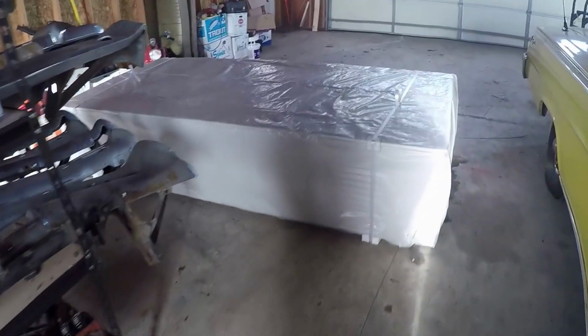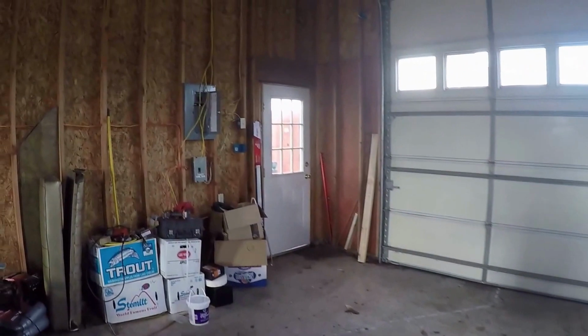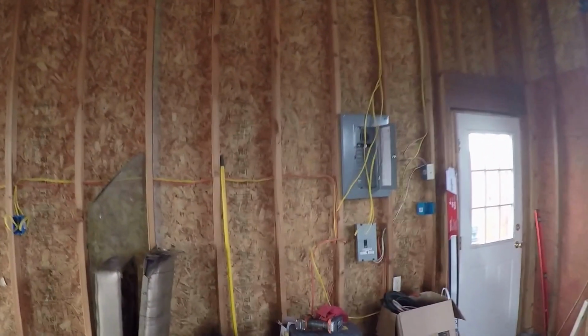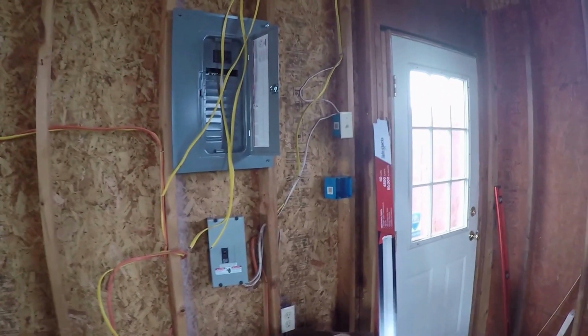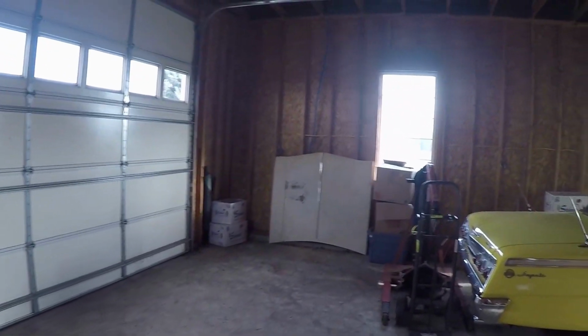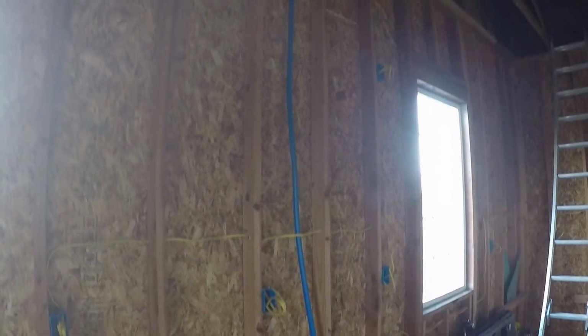The blue line is the Rapid Air Max Line kit. It's a 3/4 inch kit. It's an aluminized tubing that's pretty lightweight and pretty rigid, but I've got 3 different drops, so I'll have air at 3 different spots in the shop without having to string an air cord or an air line all over the place. I'll put a reel underneath the bench, so that's good.